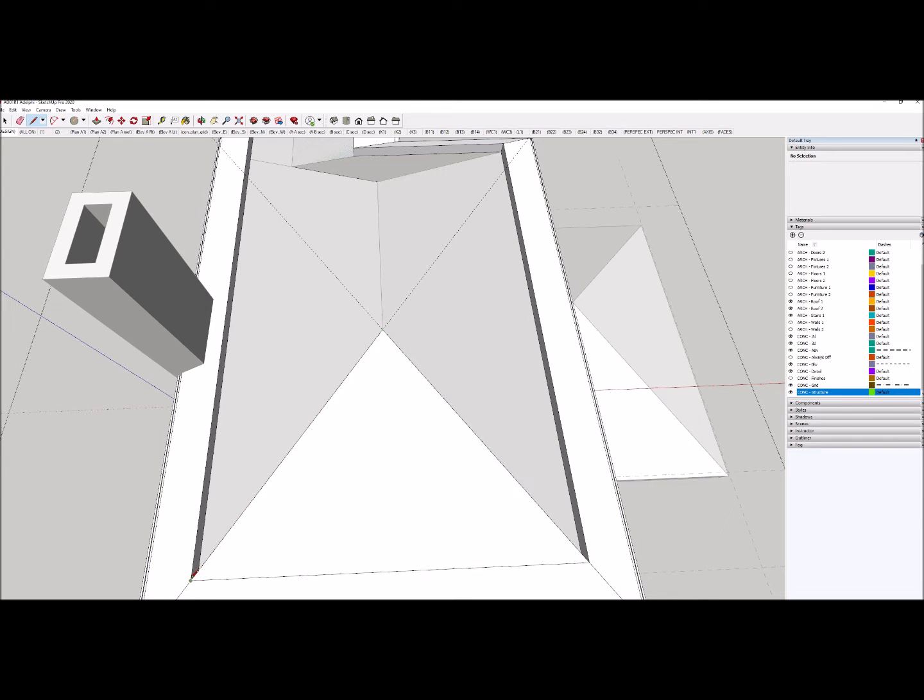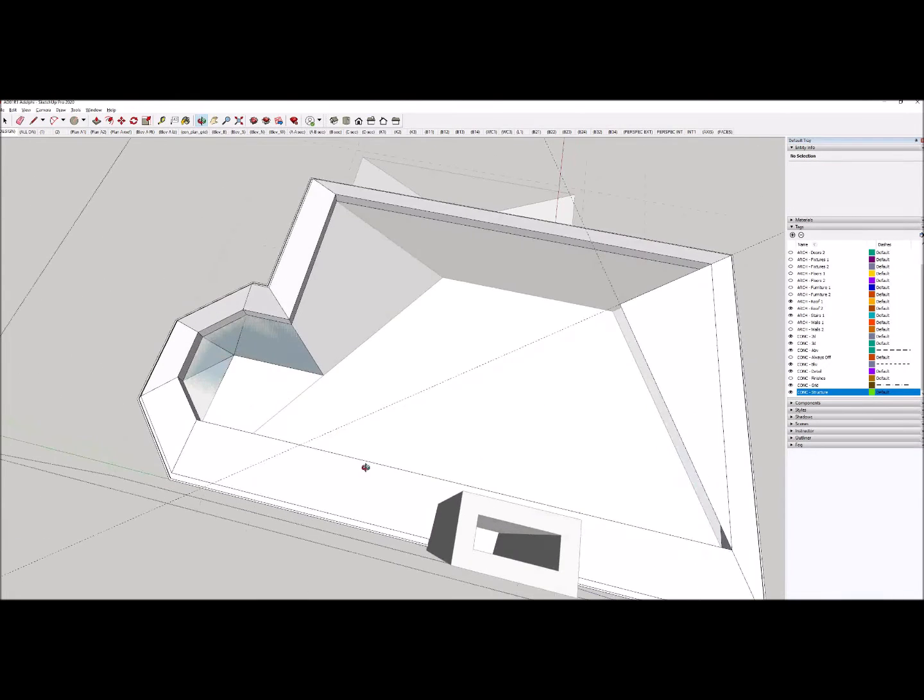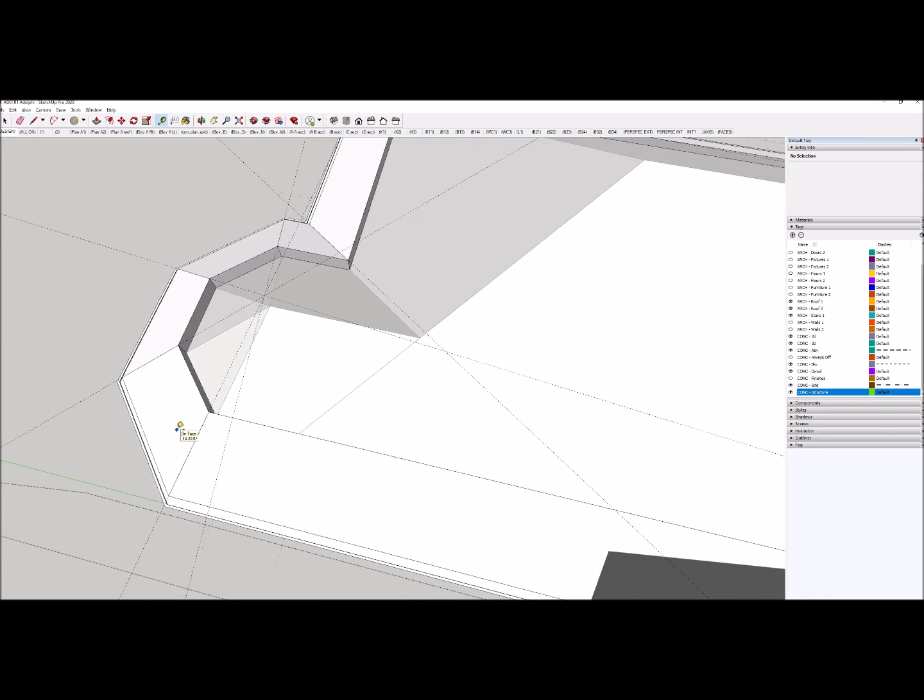The outline that I created there with the Follow Me tool gives me the lines of the hips and valleys, and then I can use guidelines on those to help me finish the overall finished roof structure.